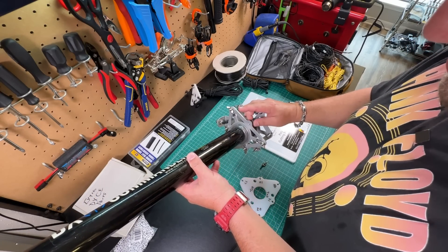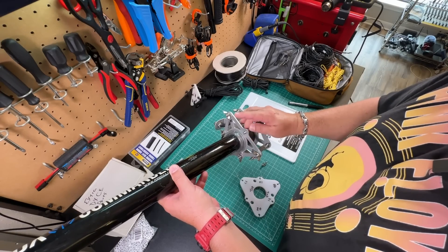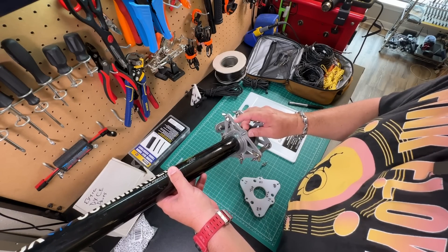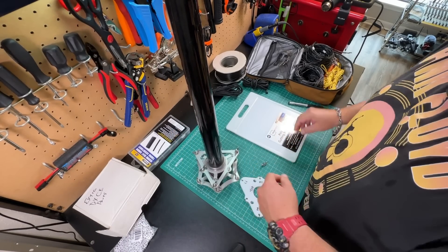You need a tuner for 6, but my tuner on my 7300 tuned it up just fine on field day, and I was making all kinds of FT8 contacts on 6 meters with this very antenna.